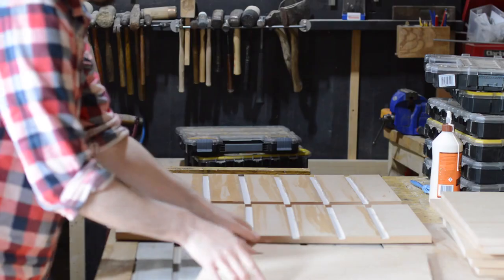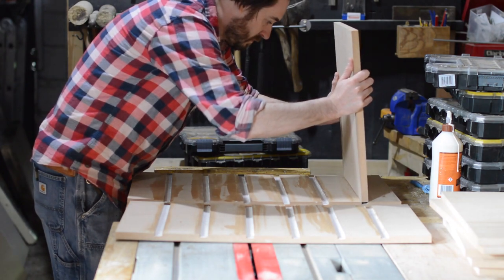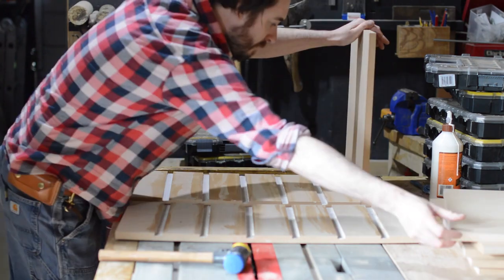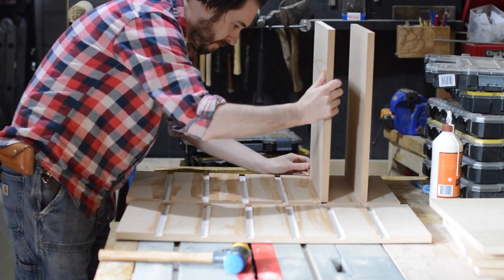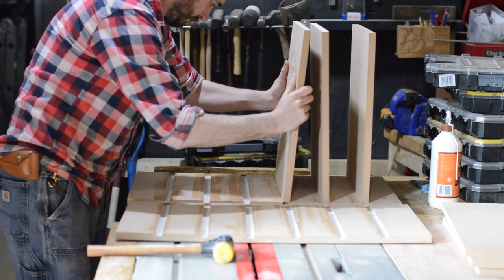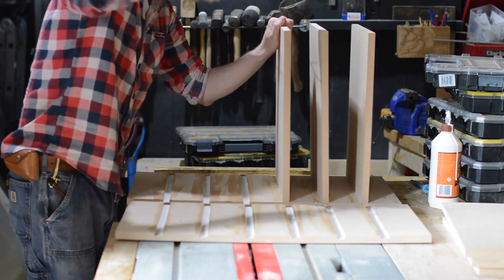I did have a little dry fit first off camera. I wasn't that confident it would all fit, but everything went fine so time to get it together with some glue. This is 18mm MDF and I got an 18.2mm router bit which seemed to fit absolutely perfectly — they just need a little tap in place and you get a really nice snug friction fit.